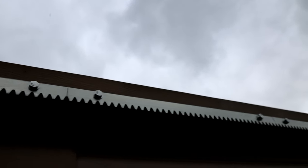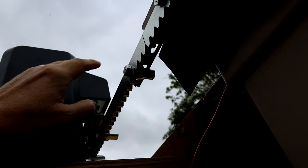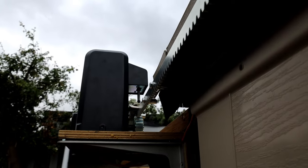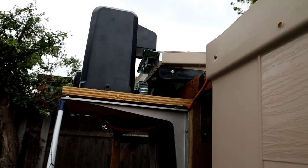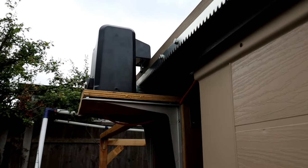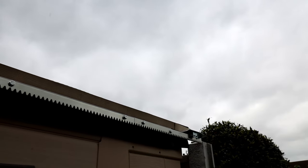This is literally just screwed up to the top of the roof on a piece of angled aluminium. These are bolted through as half metre lengths. It comes with these little spades that sit on the top — there's one at either end and this is what triggers the little sensor to tell the roof when to stop, so it doesn't overrun either end. It's a very simple rotating cog that just moves everything along. This will actually move a weight of up to 600 kilograms, which is way over the top for this roof. They do go even higher, so there should definitely be one suitable for most roofs.